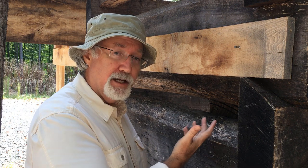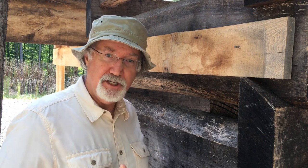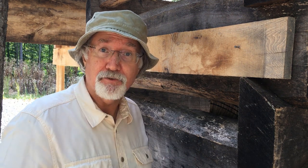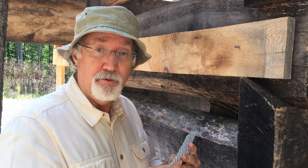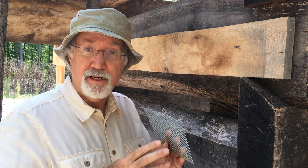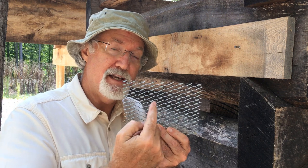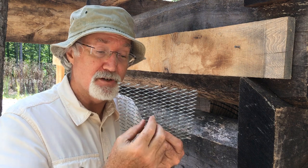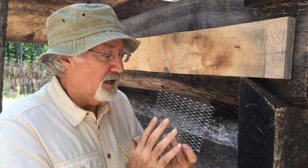When you want to apply a quarter inch of cement material, who better to learn from than individuals that do this for a living — not just log cabin builders like me, but people that apply plaster for a living. What do they use? They don't use rabbit wire, fencing, or barbed wire. They use diamond mesh plaster lathing. It's available anywhere — I can get it at my local building supply center. It comes in sheets, generally about two feet by eight feet, it's reasonably priced, cuts really well, and holds up long term.